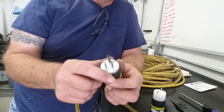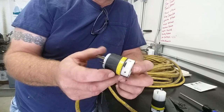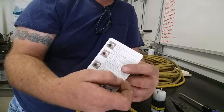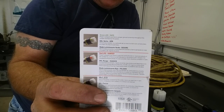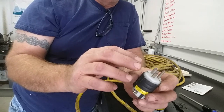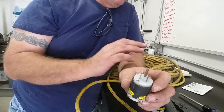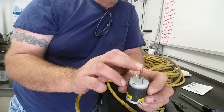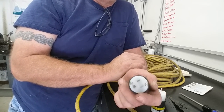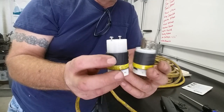We're going to get the bolt-on ends. It doesn't pay to buy cheap ones. These are made by Pass & Seymour, also known as Legrand. There's a small green board in there with a digital analyzer. On the back of the card you've got a green and red LED — green means go. When you have a green condition it verifies polarity between the hot and the neutral and verifies that there's a ground. If there's a red condition, either you're missing a ground or you have reverse polarity — two conditions can cause a red light.